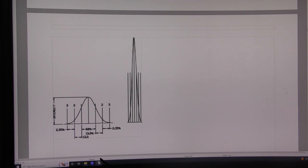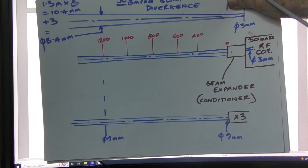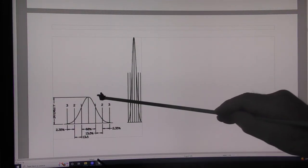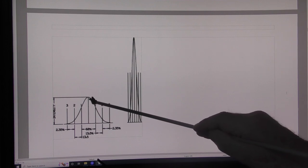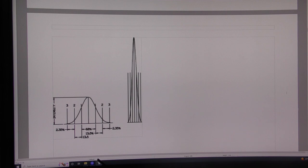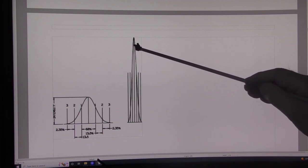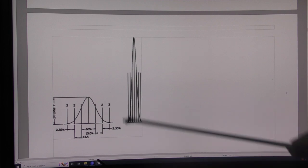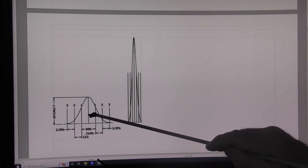The greater the intensity the faster you can damage material. For cutting, we want to damage material quickly to get through to the other side. So if we increase the beam size from three to nine millimeters diameter, we've just decreased the ability of this tube to cut - it's now blunt as opposed to sharp. An RF machine with a nine millimeter beam becomes a great engraving machine that will cut, but not very well. The strategy for my tangerine tiger was recognizing I've got a very small high-intensity beam coming out of this 30-watt RF tube.